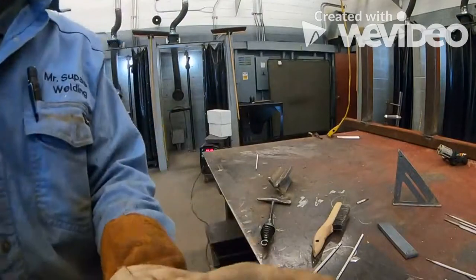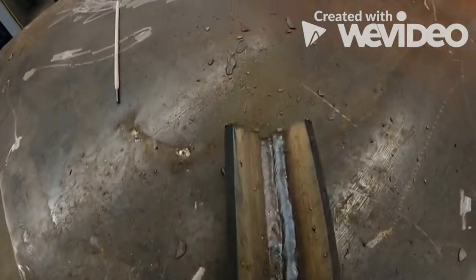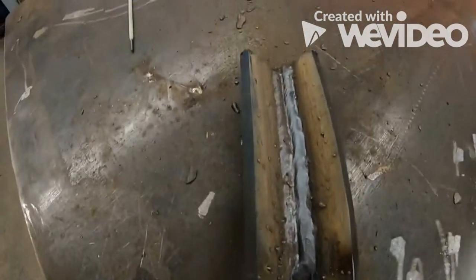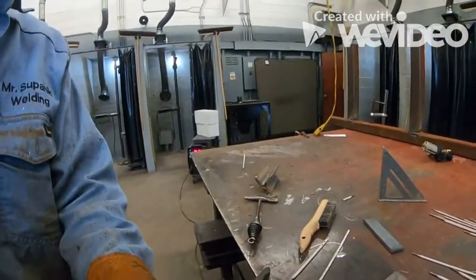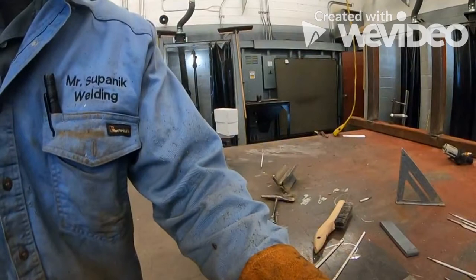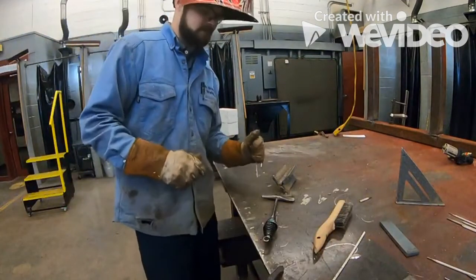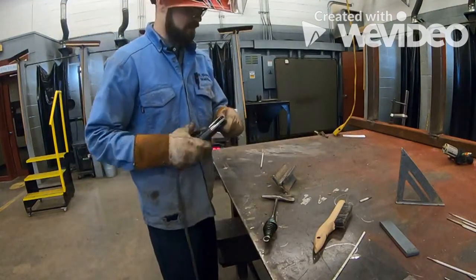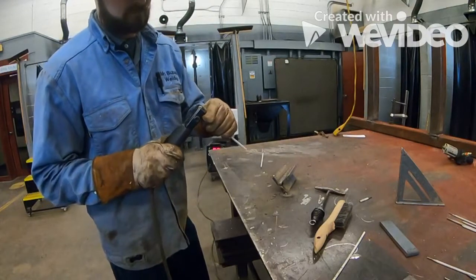Okay, here's our 4th weld, okay? First of the 3 that goes across the top. Now we're going to put 2 more across there. One tying into there, and the other one tying into the other side. Now, same thing. I'm just using a used electrode, so I'm probably only going to make it about halfway across. Okay, here we go.